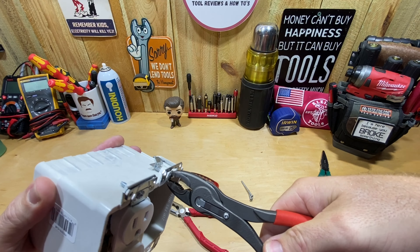If this screw were solid in a wall I could twist it around like a screwdriver. These pliers, if you're an electrician, are the size you want for ceiling box and light fixture boxes. Those screws are always cheap, they always strip out, and sometimes they don't have a slotted option so you can't use a slotted screwdriver if the Phillips is stripped. It also has teeth going the other way — almost like a pair of combination pliers — so you can get onto a bigger fastener sideways if you need to go a little larger than a fixture screw.